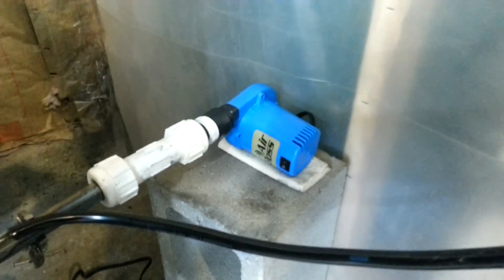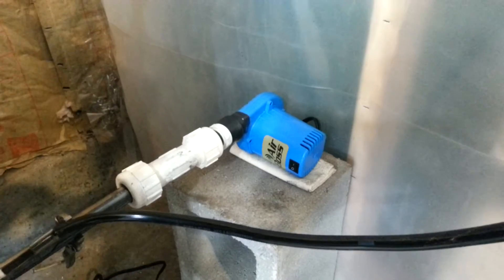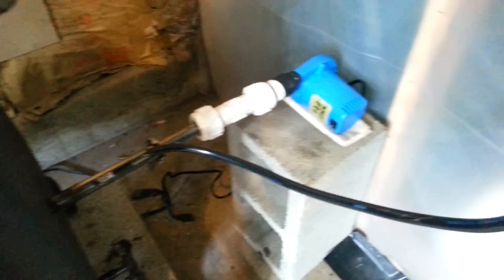Look in here — you can see the piece of pipe up there, three-quarter inch pipe with a bell coupling, and it's orange. That's how hot this thing is running. There's lots of air and it's being fired with that little tiny mattress blower — I believe it's 37 CFM, cubic feet per minute, if I'm not mistaken.